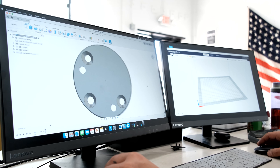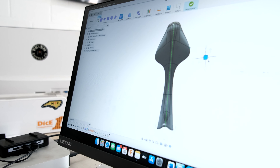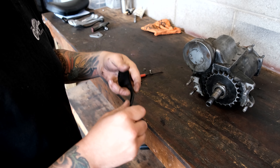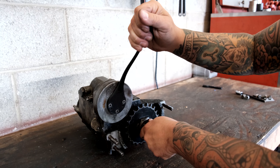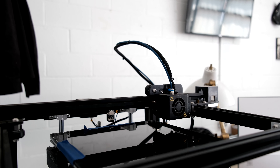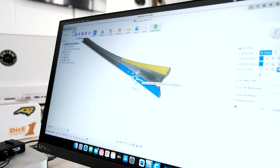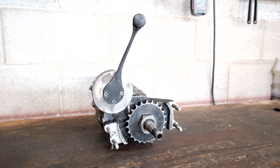In Fusion 360 we just started drawing. We started with the ratchet top where it mounts to the ratchet lid, then started extruding and coming up with different styles and angles. We had a few different options, 3D printed them, held them in our hands, compared the options, and mounted them to a transmission to check fit. From our first couple of prints we realized the web running the entire length was too small — we were worried about it breaking — and the overall length was too short, so we made it slightly larger.